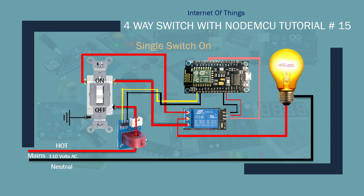Now let's hook up each item to the NodeMCU. On the current monitor side, hook up the signal to A0, which is GPIO 17, and a ground wire from the current sensor to ground. On the relay side, hook up negative to ground, positive to 3V, and the signal wire to D4. That's the GPIO I'm using — you can use any one of them; just remember to change it in your sketch.